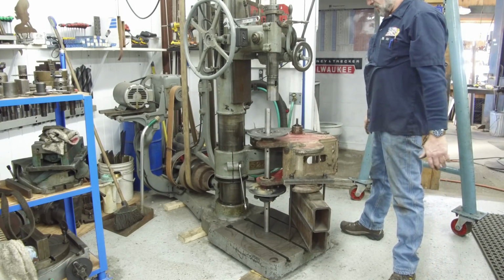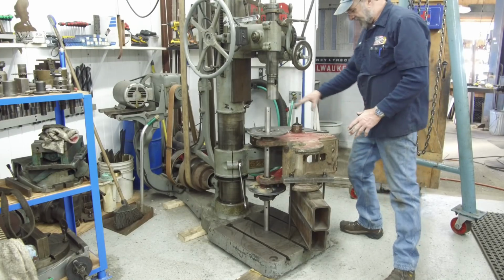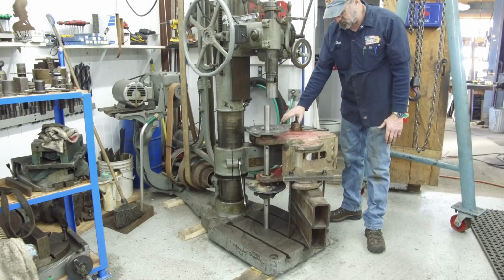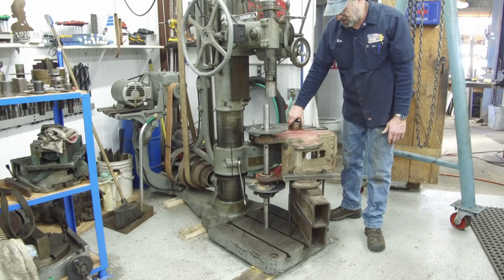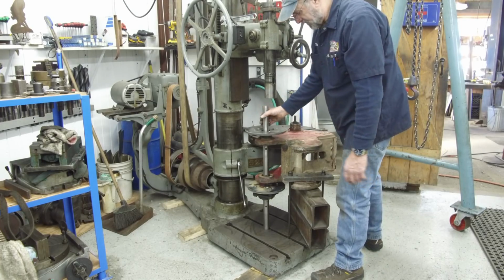We were able to get the gantry over here, you can see that, and we were able to clamp onto this, hold it up. We got this one ear, which has got a boss that mounts right down to the table on the T-nut slot, so we had the 5/8 all thread right here. We got that locked in. Then we pivoted around, and we actually had this directly under the spindle.